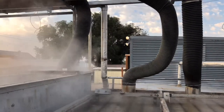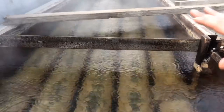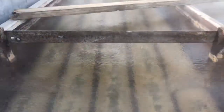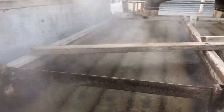Come into these condensers. I'll drop this down so you can see. See those pipes underneath there — that steam's flowing through. You can actually see this water boiling. The water on the outside is cold water, at least at the bottom, and then as it raises and gets hotter, it drains out here. We use that cold water on the outside to condense the steam back into water.